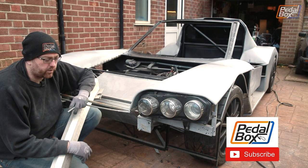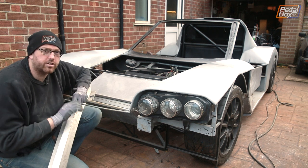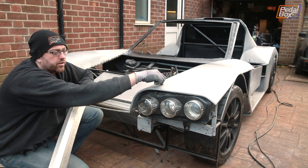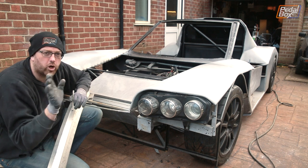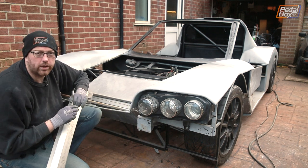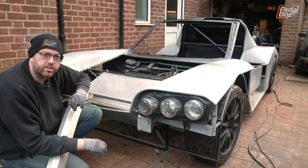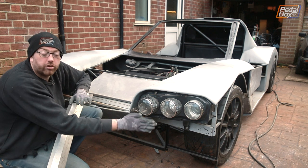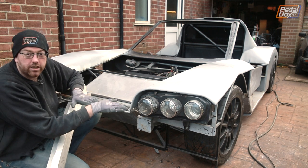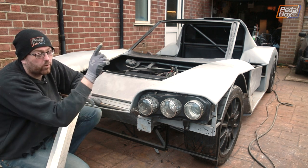In a classic piece of Pedalbox yak shaving, we've had to remove the bumper bar in order to install the next part of the arch on this side just forward of the wheel. There's a good reason for it — we have to take this off to get the frame that holds the lights out. We can't put the lights in directly because there are two screws that go down into the top that hold it onto the frame. So this section needs to come out to attach the lights and then has to go back in. Unfortunately, this small extension which came across the bottom here gets in the way so fantastically that it's almost impossible to reinsert this section properly, and if we put bodywork across there it would be even harder. So it's a lot easier to break the front of it right at this section, have the front of the car coming down on the main chassis and have everything underneath the light be removable and bolt onto the edge.